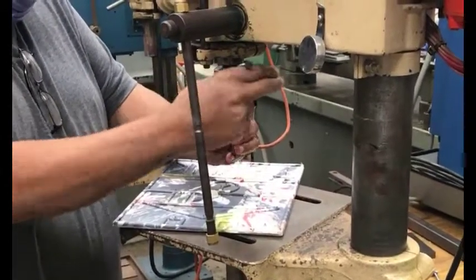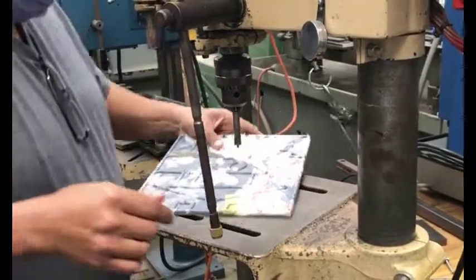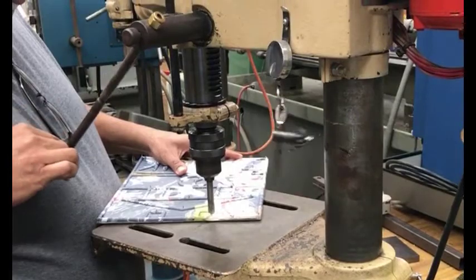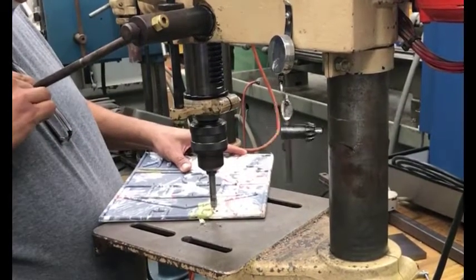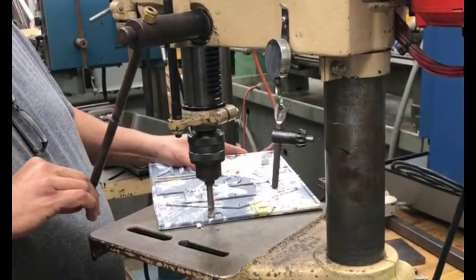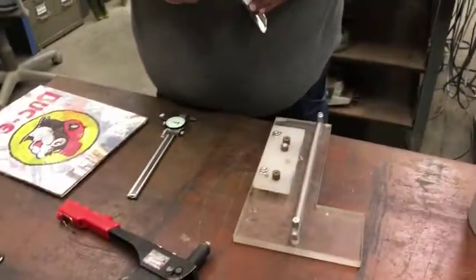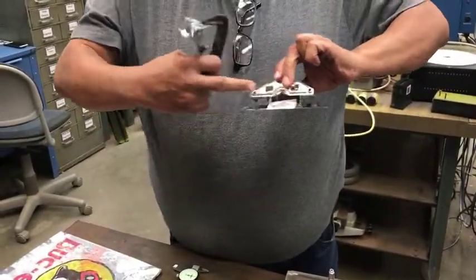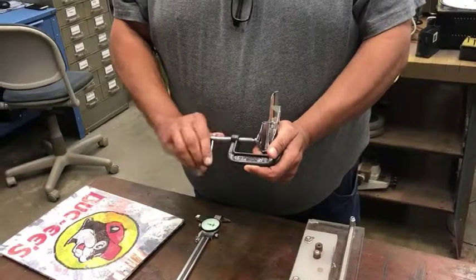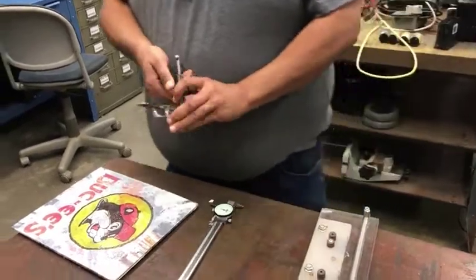The back end of some of these clipboards aren't the same, so we've got a little countersink that's going to go in there — basically just to make a flat spot on the back of the rivet so it doesn't protrude out. In order to hold these clamps, CJ's got a clamp so you can see — this shows it right there, that's where it's going to be attached. In order to hold it on, he's going to clamp that so we can use the pop rivets to clamp it on.